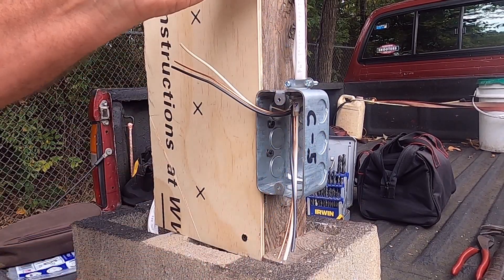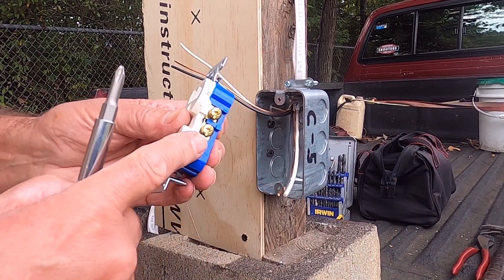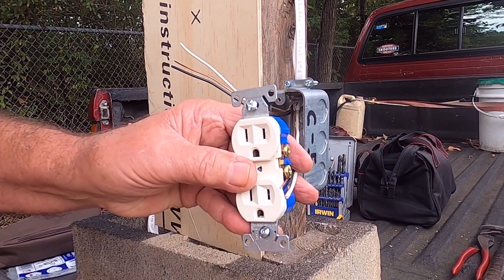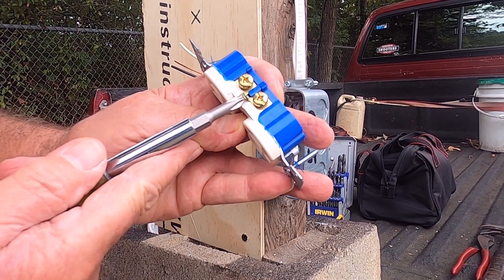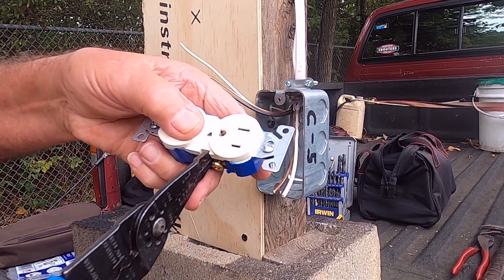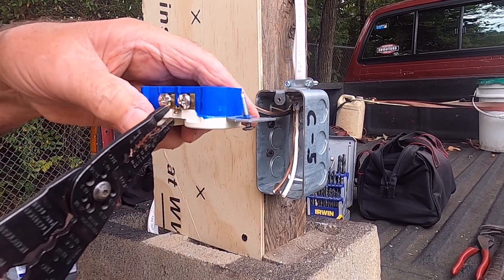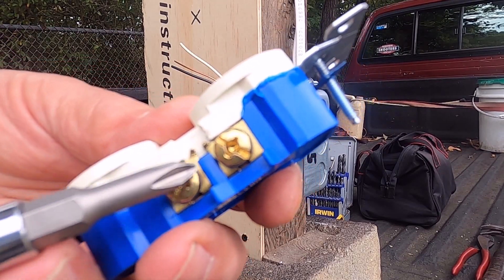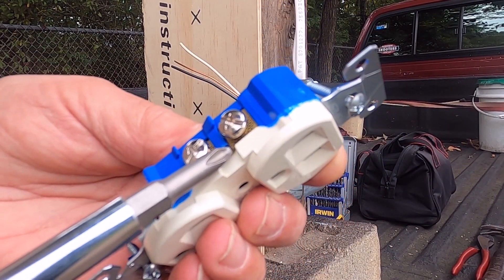See, this one is a little better quality outlet — see how much bigger your tab is here that connects your two receptacles together, a whole lot bigger on both sides. I'm going to go ahead and use this one to match that switch. So what you want to do — this is your power coming to your outlet — usually you would hook this up and you've got one power wire coming in here that powers both sides of your outlet. But what we're going to do is come in here on this little tab and break both of those tabs off. Let's come in here with some pliers — you can usually just twist them right off. You can see that I twisted it off and now they're separated. I've isolated each side of the outlet on the hot side, and on my neutral side I broke that little connector tab.